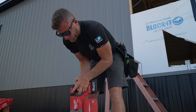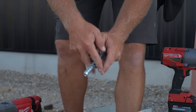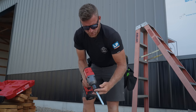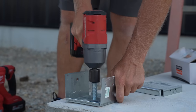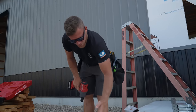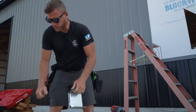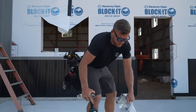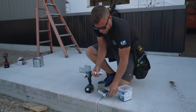So these are the anchor bolts I'm talking about, and they have like 8,000 pounds of hold down — something like that. That's how easy it is when there's no control joint. Now what we're going to have to do for these other sections is put a Tapcon in to hold it square because it's going to be very difficult.